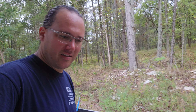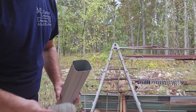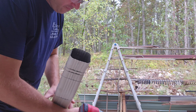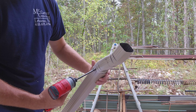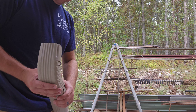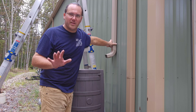We got the flange, something to peck it in with, and a hole saw — same size as the flange. It just slides up on this flange and brings it right to the wall without making the spout stick out awkwardly. Here's a side tip for all you homeowners and other gutter guys alike: you're gonna screw together your arm pieces. Note that your water is gonna come in and probably splash down on the low end of the inside, then come through on to the next piece. So maybe run your screws not where the water is gonna go — run your screws up high. Then they won't catch as much debris and they won't leak like you think they're going to.